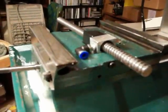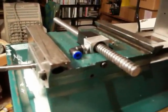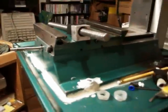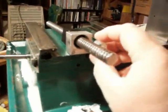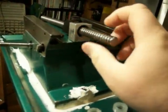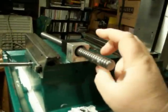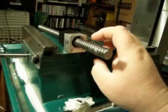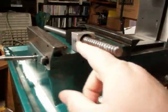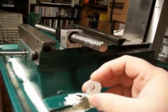I'm gonna draw it in through the side, but basically a pump onto it is just gonna roll out the end of the ball nut mount and get onto the ball screw. So I tried a couple different things to make a seal for the end. First one was just using hot glue. This is a scrap piece of ball screw, the same ball nut mount, and I got an old ball nut on there just to have a depth stop. First try with the hot glue gun - squirted as much as I could down around the inside. Problem is it dries so quick, came out a little funky, I don't think it's sealed very well.